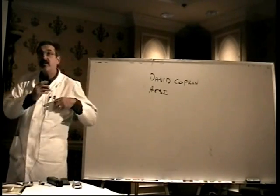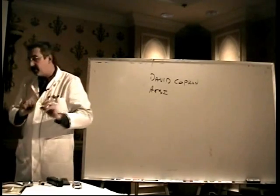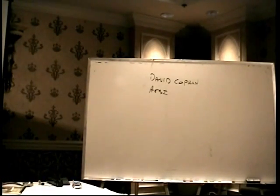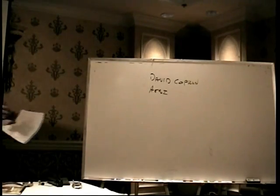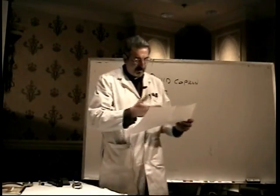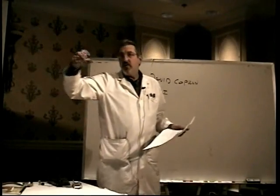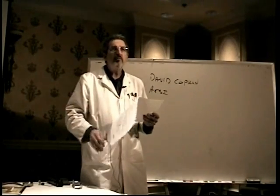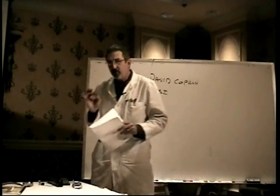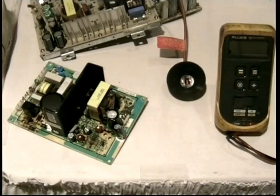Okay. So that's really all I'm going to discuss about the sync amplifiers. In the rare case that you have a sync problem, look at the schematic diagram. Whatever the sync goes into, check the parts in that section. One of the cool things that you'll see about schematic diagrams in modern monitors in general, this is really a neat trick. One of the things you're going to have trouble with when you first start working on monitors is figuring out which parts do what. Which is the power supply circuit? Which is the video circuit? Which parts are horizontal and so on? In a well-drawn modern monitor, they have a really cool method of showing you what part is what. I'm so grateful for this.